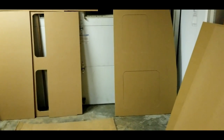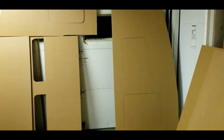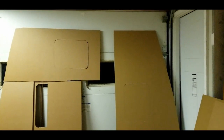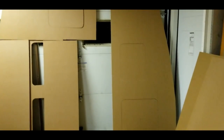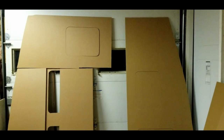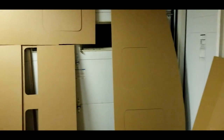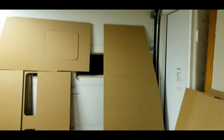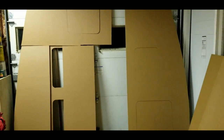This hull's gonna have 3/4 to an inch of insulation. Knock down the condensation, hopefully keep it a little cooler in the summer, make it a little hotter in the winter. A little quieter too, I imagine, the water lapping against the hull, but I don't see that as a positive. I like hearing all those noises. But there it is, next piece of the project.